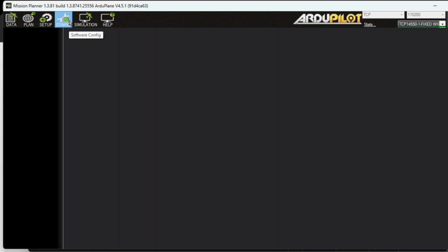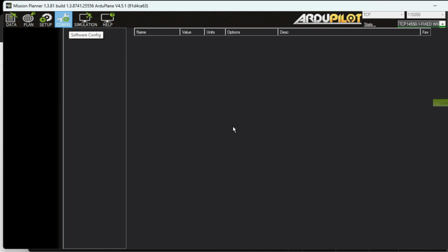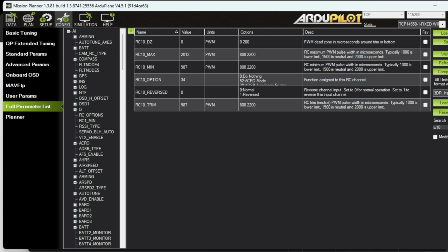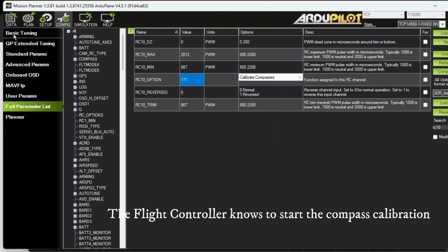All right, so after it's done, we're going to go to configuration tab, and in configuration tab you want to go to the search and you type in RC10. RC10 is our channel 10, and in the options, this is the most important part. You want to set this to 171, and after we've set that to 171, we have to write parameters. That's what would enable the channel to do the compass calibration.